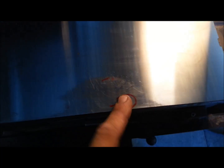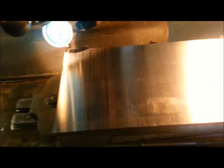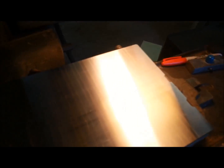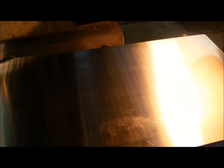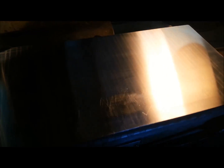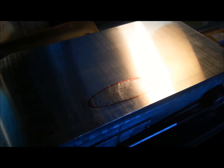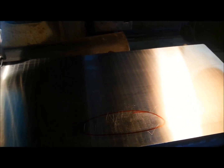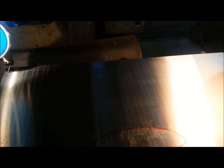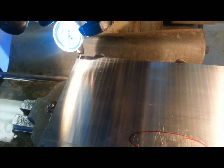I made all my last passes with the ruby wheel. I'm hoping you guys can see that finish — you can still see my holiday right there. It's just skimming, just floating across, just dusting the very high spots. When I say dusting, all you can see is a slight variation as the wheel passes by. I don't think that's even a tenth — that little area — but we're going to measure it and find out.